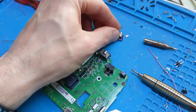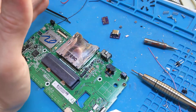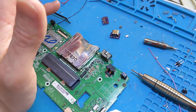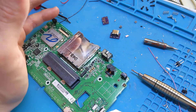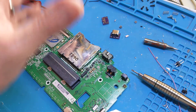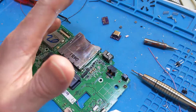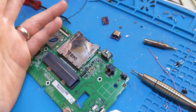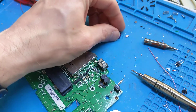I didn't have enough room on the board to add two resistors, so I've gone the route of the Raspberry Pi 4 — and you know how that went. It was only some electrically marked cables that wouldn't work. I don't think you'll come across many of those cables in the wild. All the cables I've tested — like Switch cables and other random ones — all work fine, so I'm quite happy with it. Maybe in the future if I get problems I'll add another resistor somewhere, but the board is small enough as it is.